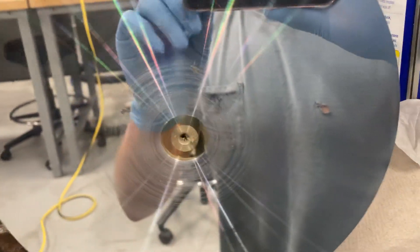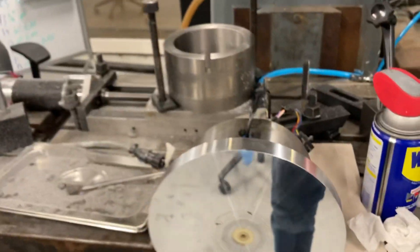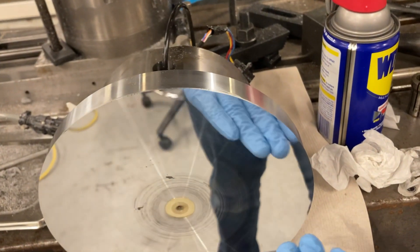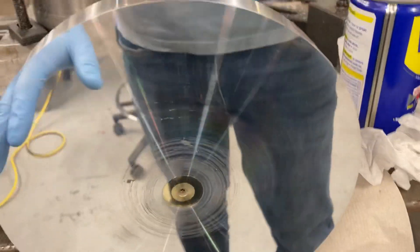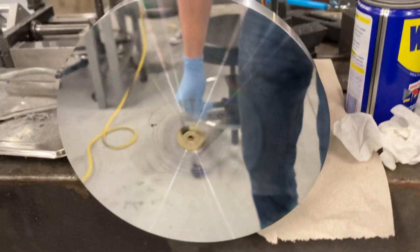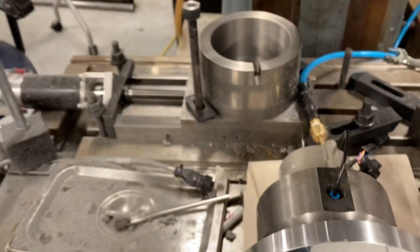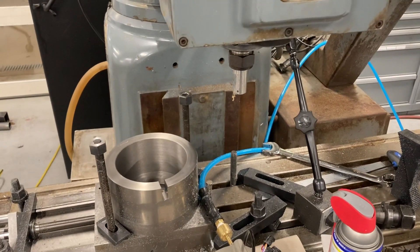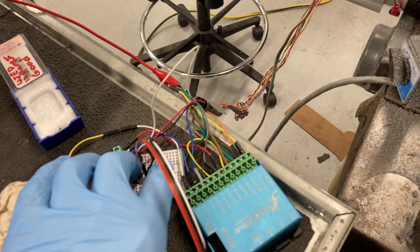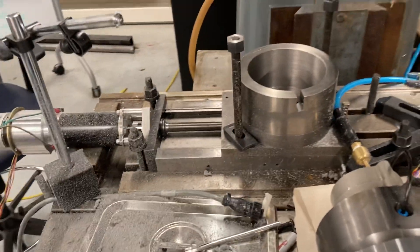And there is some general diffraction going on here, you can see — and that's because this is a PCD tool. There are grains to it; it's not perfectly sharp. And that's what's causing the diffraction: this is really not an optical finish, if you want to use the technical definition of optical finish, which is less than 10 nanometers. So that's the setup there. It's really simple — we just touched off, incrementing in 10ths until we hit. And then I just have three buttons over here; I can press those buttons and it changes the direction of the axis. That's really all there is to it.